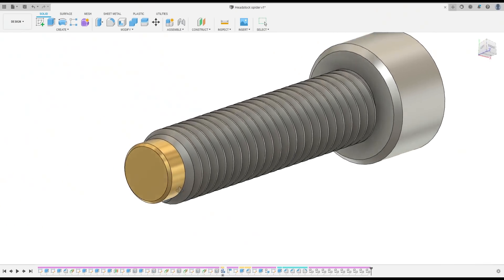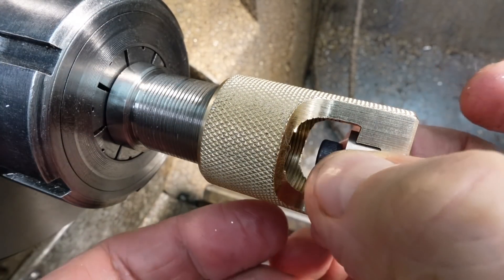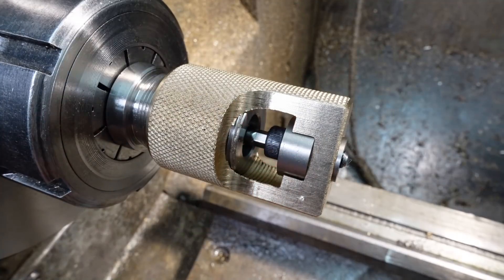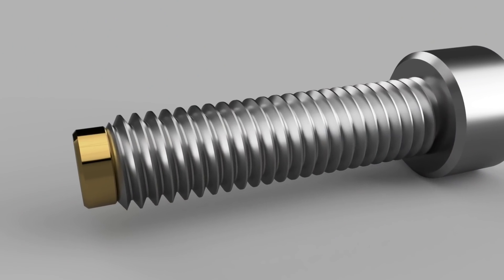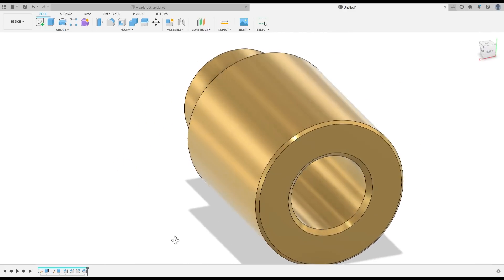For that I'll be using the lantern chuck I made previously. It'll need a new custom collet machined so it can grip the head and align the shaft of the screw as it's machined to length, drilled, countersunk, and then has the brass head pressed in and skimmed to size. The collets need to be around 16mm OD with an 11mm spigot to fit into the lantern chuck nut.